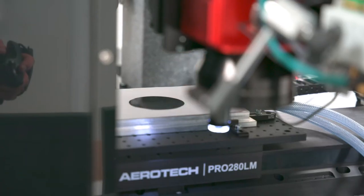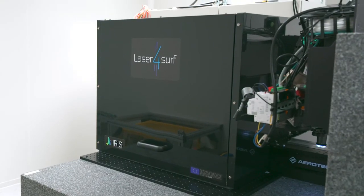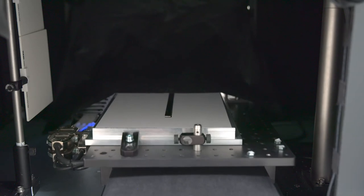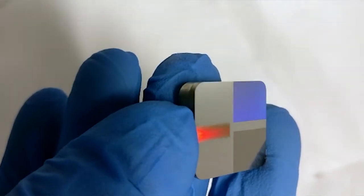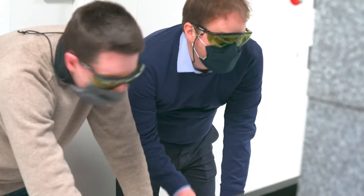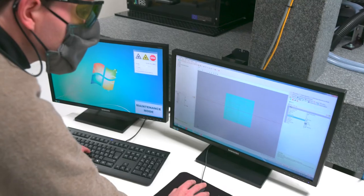All three end users are keen to adopt the new technology on their new product lines, also because the laser machine comes with an integrated quality control unit inside a black box. After the laser treatment has taken place, the sample moves inside this unit for a thorough check-up using diffraction optics. When light is directed on the textures, the rays are diffracted depending on the induced surface structures, and a software analyzes the pattern and verifies their parameters. A sophisticated software was also developed by SAIT, a Spanish institute focused on applied research, to integrate the different units of the laser machine into one functional system.